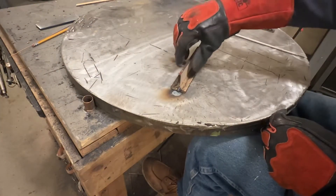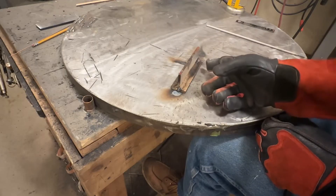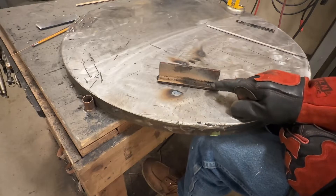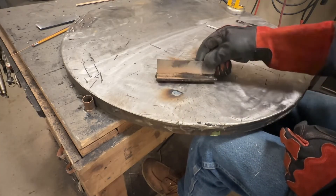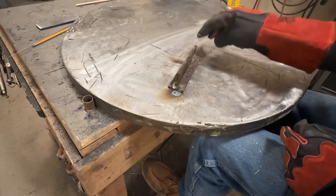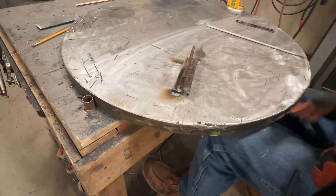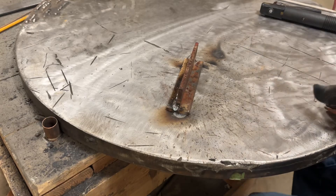That welded with excessive amounts of spatter, and the molten puddle surprisingly seemed to hang way far back - not really sure what that was about. Looking at the bead appearance, I don't think this was grease-soaked at all, but I didn't prep it. There's this black line and I'm not sure if I boiled grease out of it or what, but bead appearance is pretty terrible. I'm going to let it cool down five to ten minutes, then run a pass of 7018 on the back.